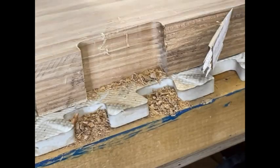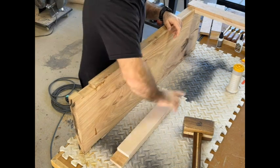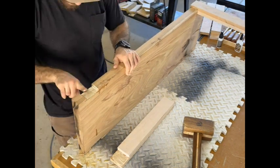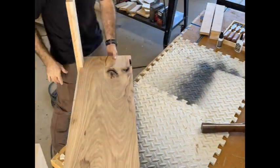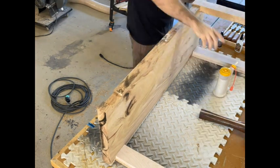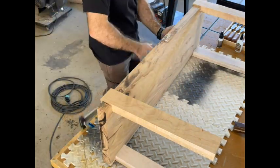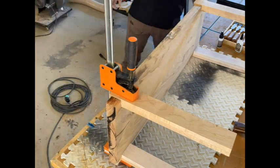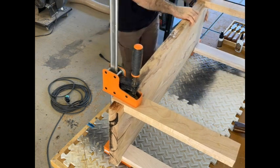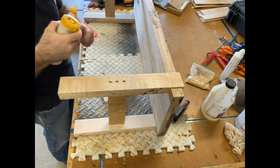I wanted to use the table saw but it just didn't work out, so I ended up going with the router setup. There was a little bit of tear out, but that was kind of perfect because it glued almost exactly back in place — you could almost not even tell it tore out. I'm using a finger to spread the glue because you don't want to trust just the pressure of the clamps — make sure it gets into every single crevice. Hammer it in, spread it around, throw some clamps on it. One downfall of using a parallel clamp is the tip is two or three degrees off, so I just moved it back and put the leg back square.